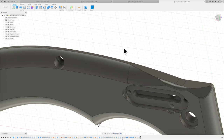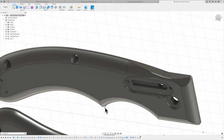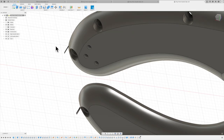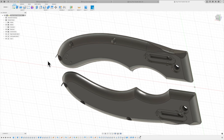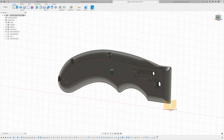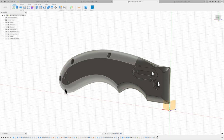When I went to do the CAM, Fusion understood those little pieces were there and tried to machine around them, leaving big islands of material. I did some reading — not a lot of info on cleaning out little bits in Fusion — but eventually figured out how to get rid of them. The sweeps weren't too bad; a couple of hours adjusting my sketch by a few thou. But it took me about six to seven hours to figure out how to clean up the loft.